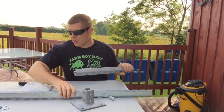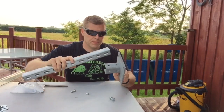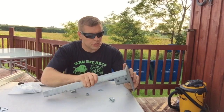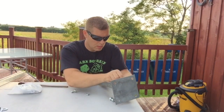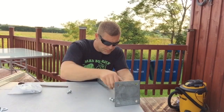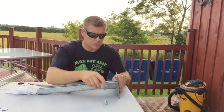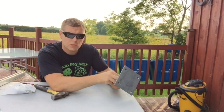There we go — we've got our piece for the hangers. The next thing is to attach it to the foot. You can see the holes in the bottom of the strut line up with the holes in the foot, so we keep our nice end out. We take our bolts and nuts — the bolt goes straight through — then we put the strut in here. It fits like a puzzle. Put the bolt through, put a washer on the inside, then put the nut on. It takes two bolts and two nuts. Tighten those up nice and snug. It's great to reuse materials — all you have to purchase is the foot from any electrical or hardware store.